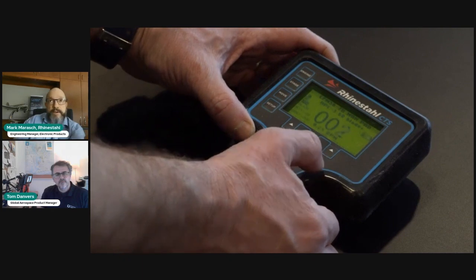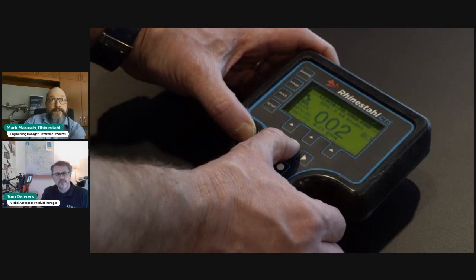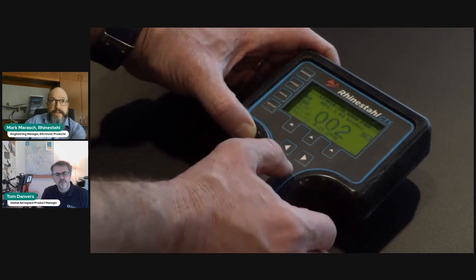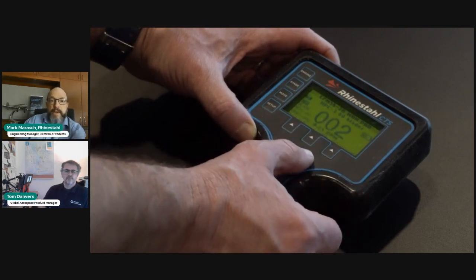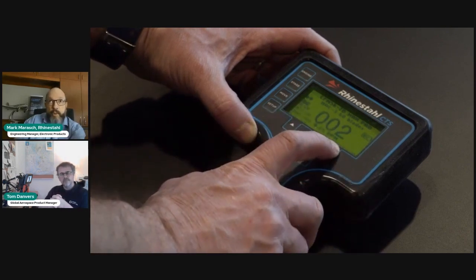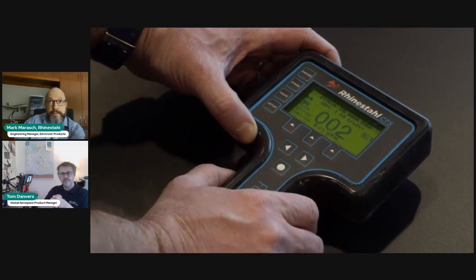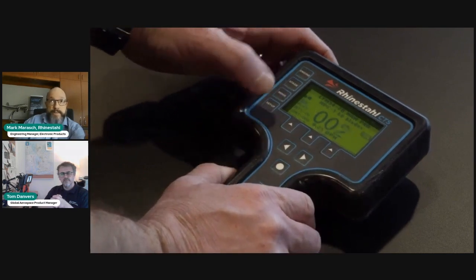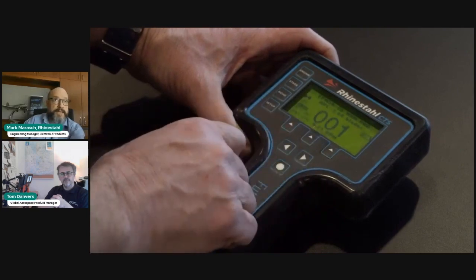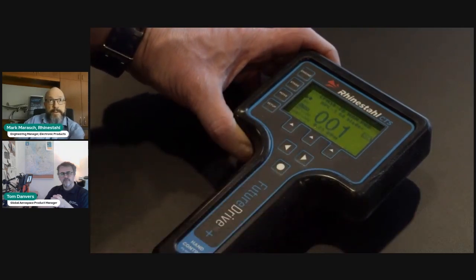Now we're going to jog the engine around until we've placed the first blade, blade 1, into the desired position. Anytime we reverse directions, you'll see the backlash screen pop up. And once you've set it, you hit the set view position button and it records that position. You can either hit the button a second time, or you can move into any of the move menu items and it will reset the screen and show you that you are now on blade 1.